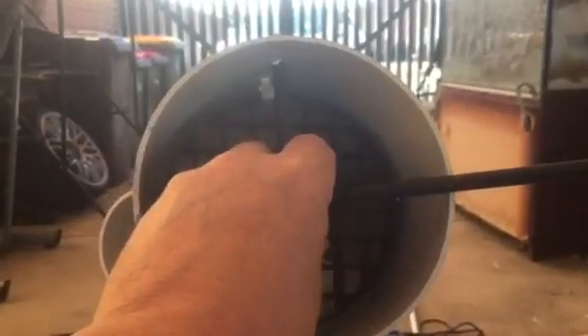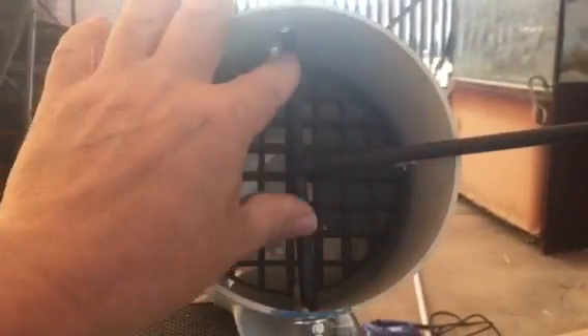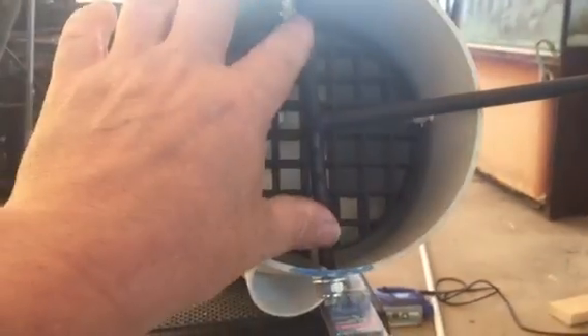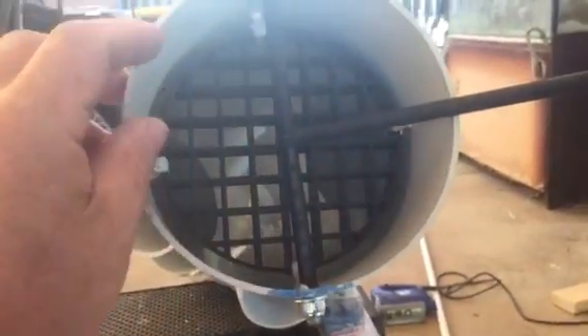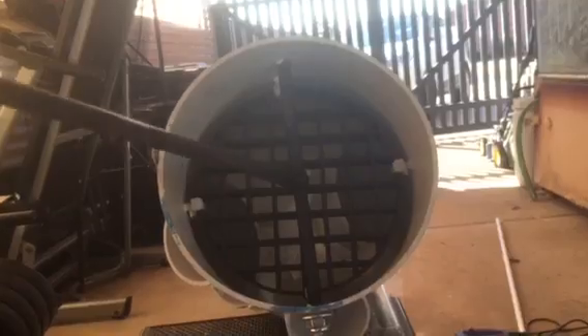On the top here is what I just made — it's a piece of 8mm threaded rod and I've welded it just here. On the outside to keep it waterproof I've used shrink wrap, put that straight on and used the heat gun, and that makes the whole thing waterproof — a little bit extra around the weld as well.